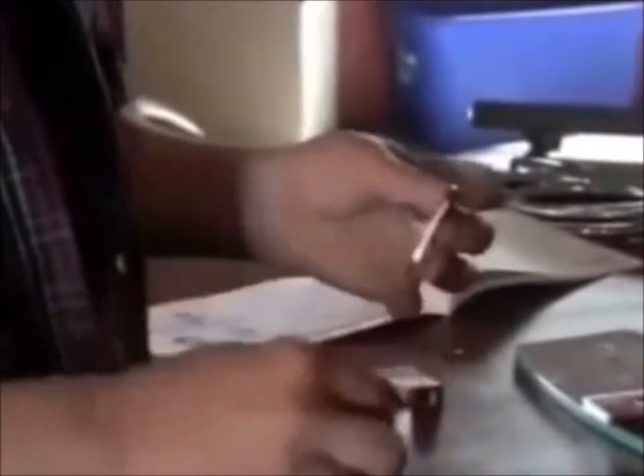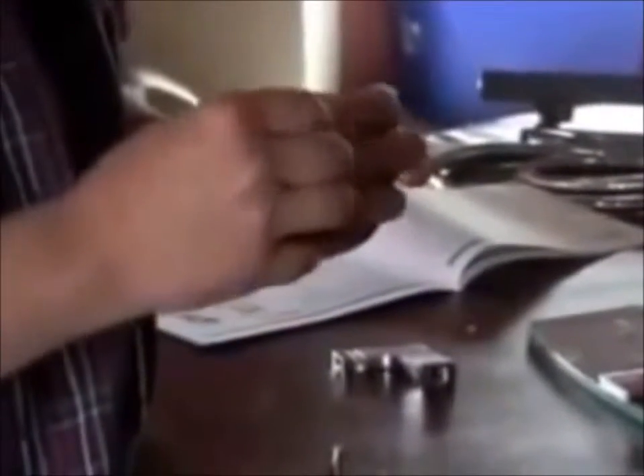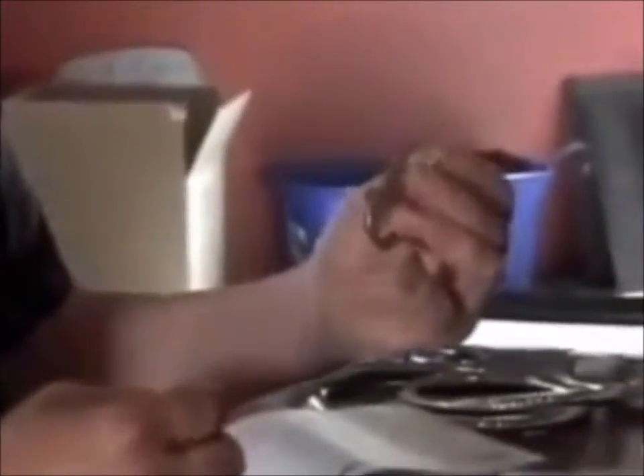We're going to mount the soap tray. Here's your mounting bracket — on the top there's a set screw, we'll loosen that off and open it up. Cosmetic plate over top and here's your mounting bracket. For mounting this, you're going to put the screw through with a rubber bushing — that's going to go up against the glass. On the back side of the glass, take a flat washer and then the nut — it's going to get sandwiched in between there.